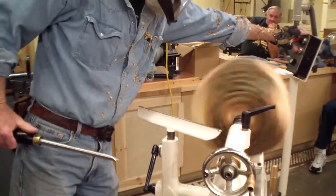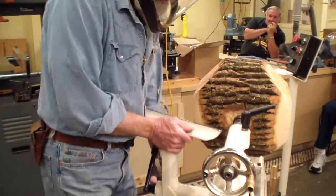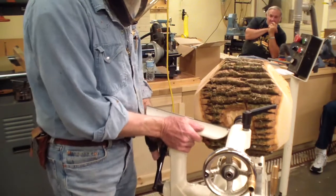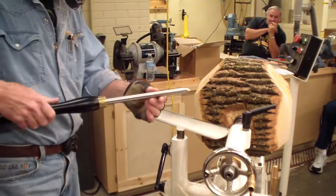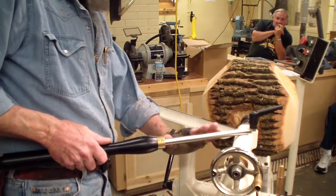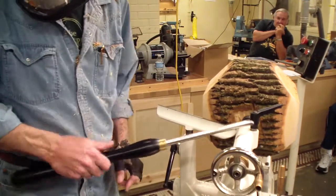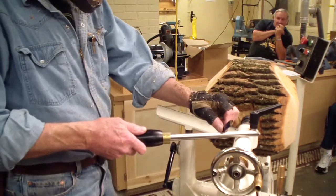Now, the roughing cut is designed to do exactly what it sounds like. Take care of the rough stuff. And in this case, what I'm doing is bringing the tool in horizontally to the material with a 45-degree angle across the top of the flutes. Let me get my pencil here so I can illustrate that. A little bit that way, like so.